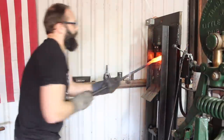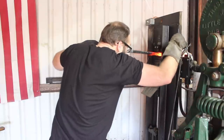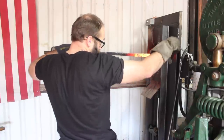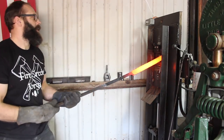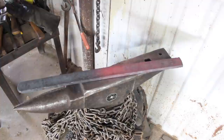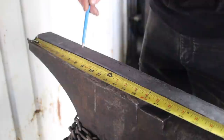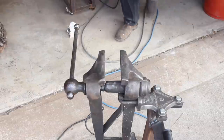It actually does resurface unfortunately a little later on, so I'll talk about that briefly. As I've said before in previous videos, any time you change one ingredient or one aspect of a particular process, it has the potential to throw everything off following that. I figured out what I did. Here's our billet drawn out for the first layer — that's 35 layers, and I cut that up into six pieces to get my little bit over 200 layer count, which is what I'm after.